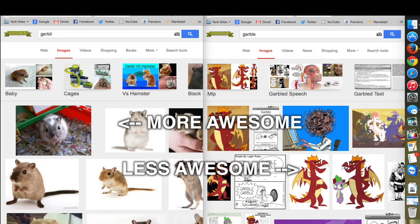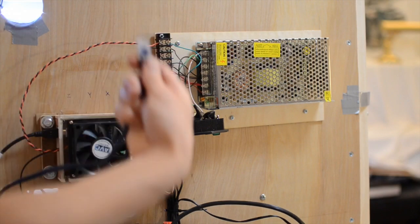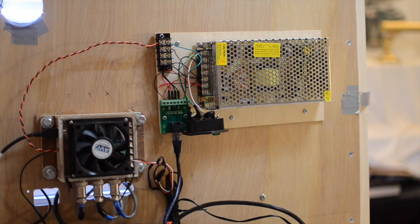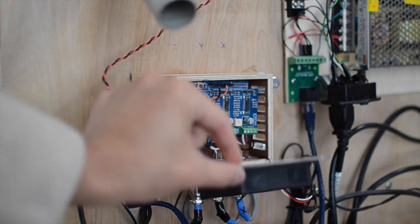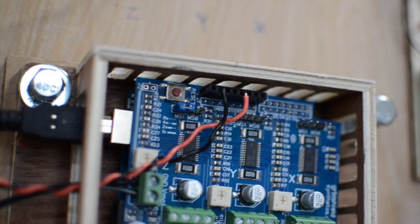The other bit of work you have to do to get LaserInk up and running is to connect the spindle speed pin on the G-Shield to the laser head via a terminal block and Ethernet breakout board. Spindle speed is sent over pin 11 on your Arduino, but to access it you will need to go through the G-Shield. The best way to do this is to install some headers on your G-Shield so that you don't have to permanently solder wires to it.